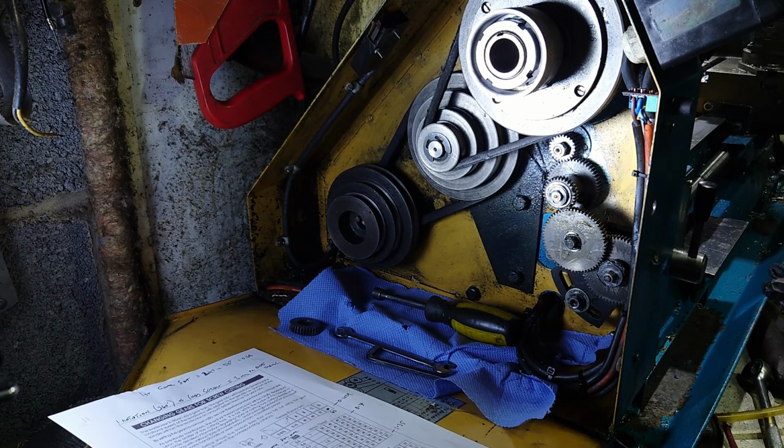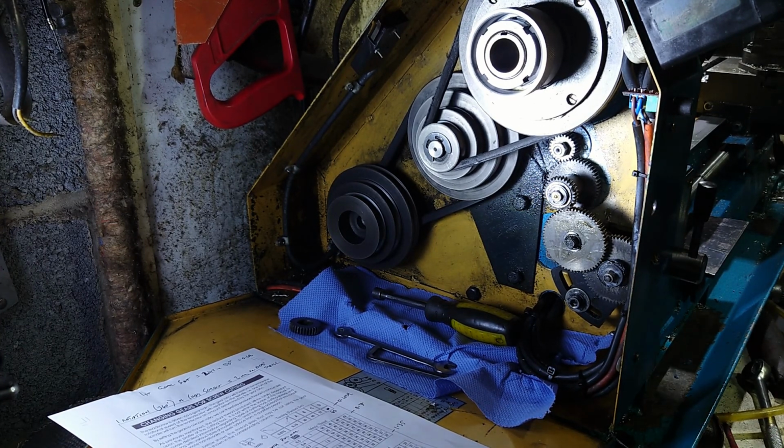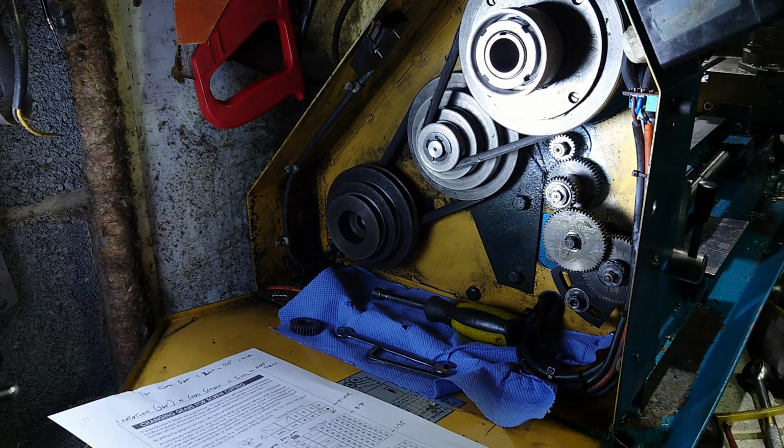So when you're doing your roughing cuts, it's 0.15, and when you're doing your finishing cuts, it's 0.075. That's what this lathe is designed to do. I could modify it, but I'm quite happy at those speeds. The tools seem quite happy at those speeds, and I tend to change the rotational speed more than anything else to stop any chatter, which I don't get a lot of anyway.